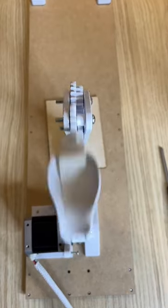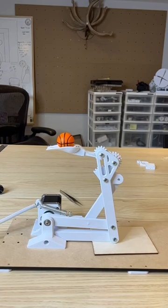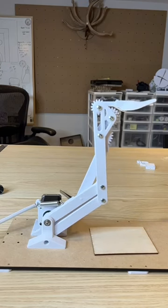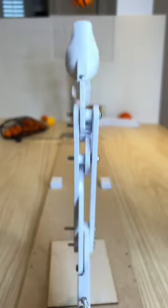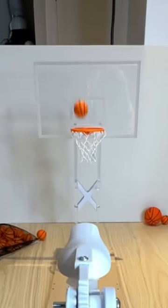The second benefit is this adds a little bit of speed to the scoop. Because of the 2.6 to 1 gear ratio, the scoop is moving 2.6 times faster than the activating link, and that allows us to add a little bit of flick to the ball, giving it some backspin and giving it some range.